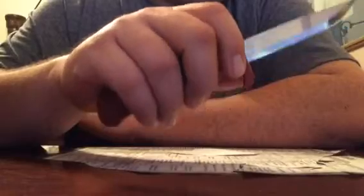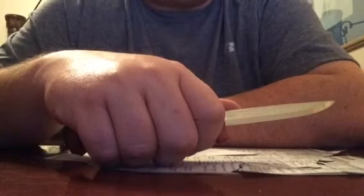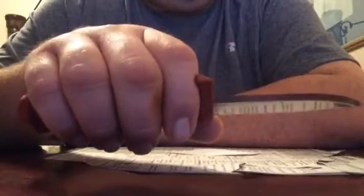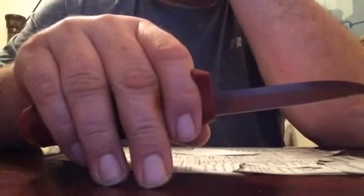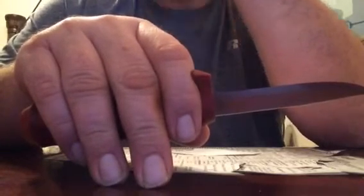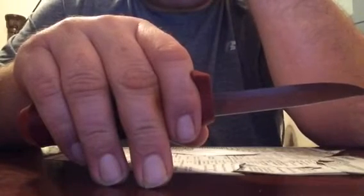So what I did, being so bright and intelligent and smart and sophisticated, I started hitting it with the edge. I mean, the sparks flew like you wouldn't believe, but the edge got ruined. My Scandi grind got bent, had some chips and stuff. You have a very thin edge. Well, I came back in, and I'm going to take out my diamond plates to put back my Scandi grind on it and resharpen it.